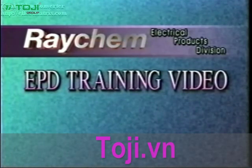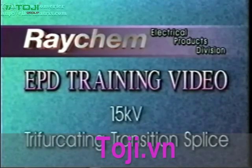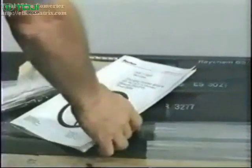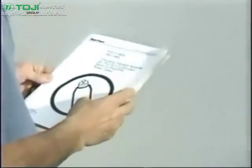This tape will show a laboratory installation of a 15 kV heat-shrinkable trifurcating transition splice for 3-conductor paper-insulated lead-covered or varnished cambric lead-covered cables to 3 single-conductor extruded dielectric power cable. Complete written instructions are included with each splice kit. Be sure to read and follow these instructions carefully before installing your splice.